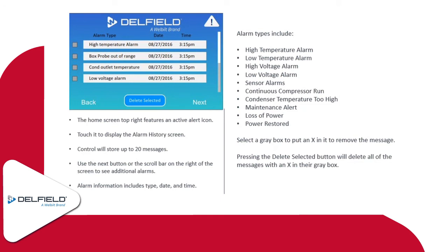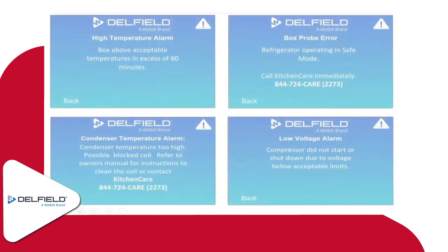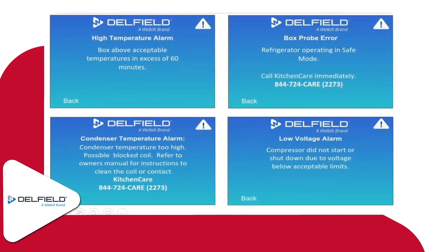If you press the little gray boxes on the left hand side, you can delete all of those. But when you look at these, pay attention to the high temp alarm, box probe out of range, condenser outlet temperature, and low voltage alarm. On the next page here, you'll see what will show up when you press on one of those. High temperature alarm: box above acceptable temperatures in excess of 60 minutes kicks off an alarm. Box probe error: refrigerator operating in safe mode.